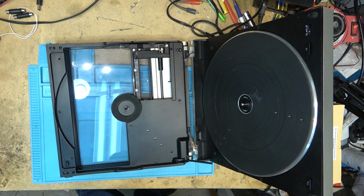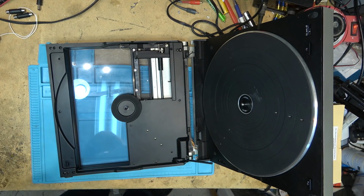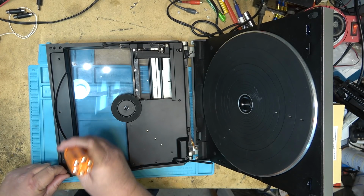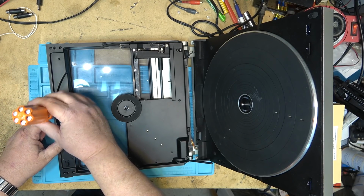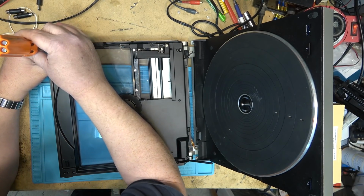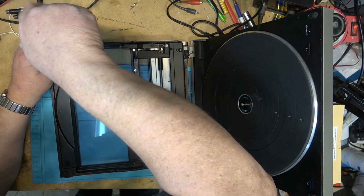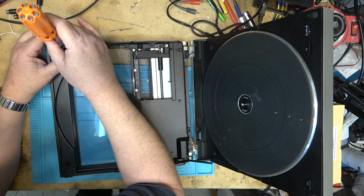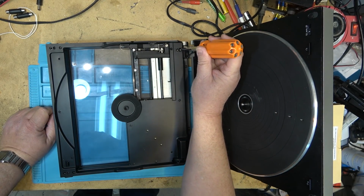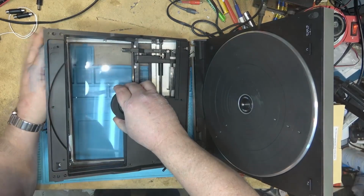That blocker, this thing here, is used if you were dealing with translucent records, because record companies, of course, toyed with bringing out special collector's edition records that were transparent, and that caused havoc with these machines. You don't know how many people threw that sheet out. They didn't realize what it was for, and they thought, it's just a piece of paper, and they threw it out, and then they get a transparent record that doesn't play, and they bring the machine back thinking it's a defect. And we're telling them, well, when you're going to play those records, you're going to have to stick some black tape over the 3 sensors to make it play, or buy another sheet. And when they found out how much that sheet cost to buy, they were going with the tape option. Oh, that just fits over a tab.